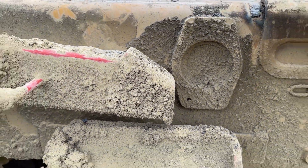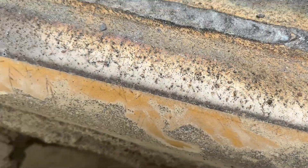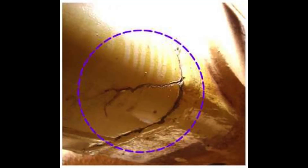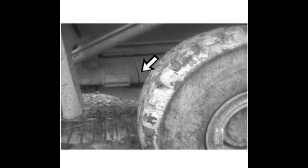This one cracked along the top, right along the seam, and you can see the welder already got to it this morning. Now if you look at the pictures here — this first picture is from the CAT CISWeb website. These are actual pictures they have showing how it can crack at the bottom and work its way up vertically along the sides of the frame rail.